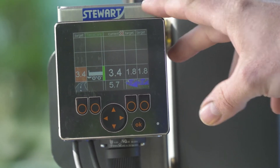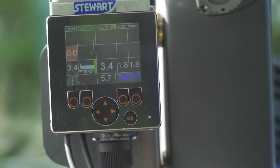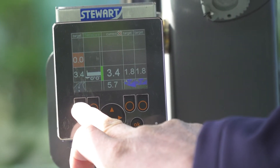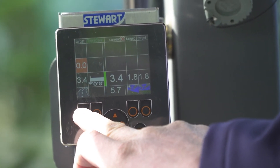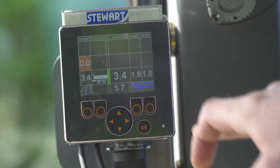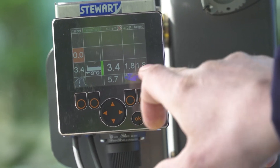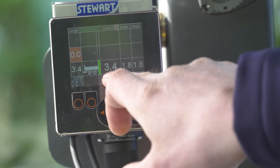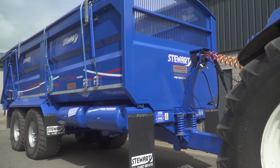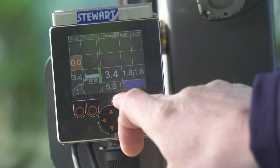So that's our CTI-S controller. What you can see in here is our preset road pressure and the field pressure. We have 3.4 bar as our base road pressure, which gives us the possibility of driving on the road at 50 kilometers per hour. And then it's 1.8 bar as a field pressure, allowing us to drive at 10 kilometers per hour with the tires deflated. The system is currently operating at 3.4 bar and our air supply pressure is at 5.8 bar — that's how much air the tractor is producing now.